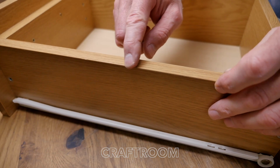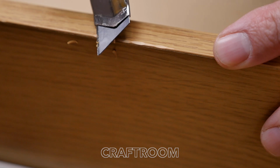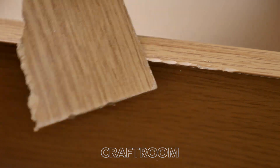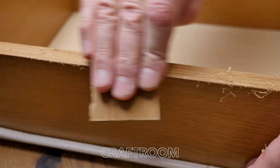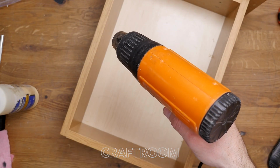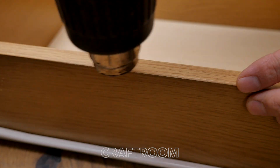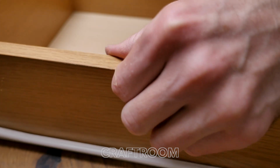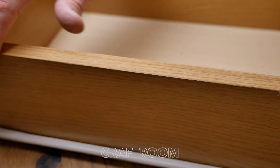Here we have a usual PVC edge 1 mm thick, with all sorts of scratches, cuts, and heaven knows what appeared in it. Everything is treated with such a small piece of HDF. Everything is perfectly cleaned with the help of such polishing. Although a rather deep wound remained inaccessible with HDF. Therefore, we take a heat gun and heat the edge. Plastic shifts color to the original on exposure to temperature. And the bright spot disappears. A piece of cake.